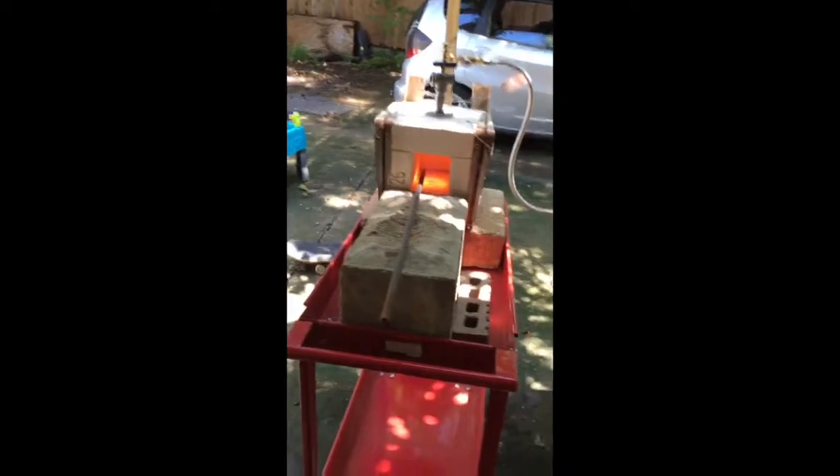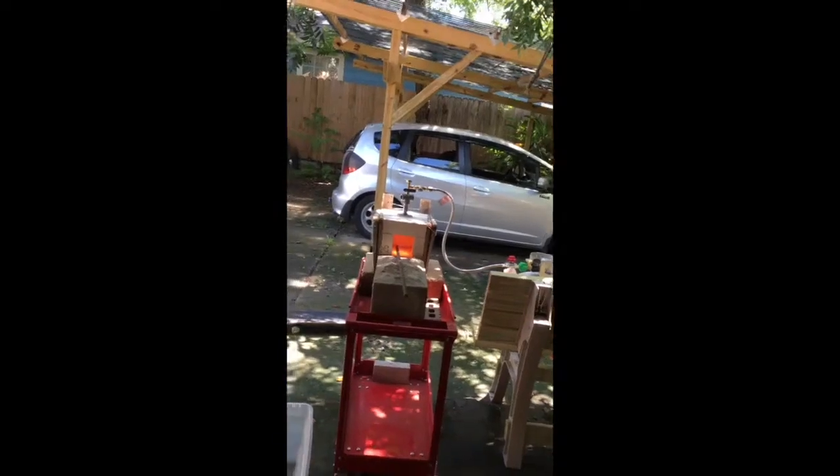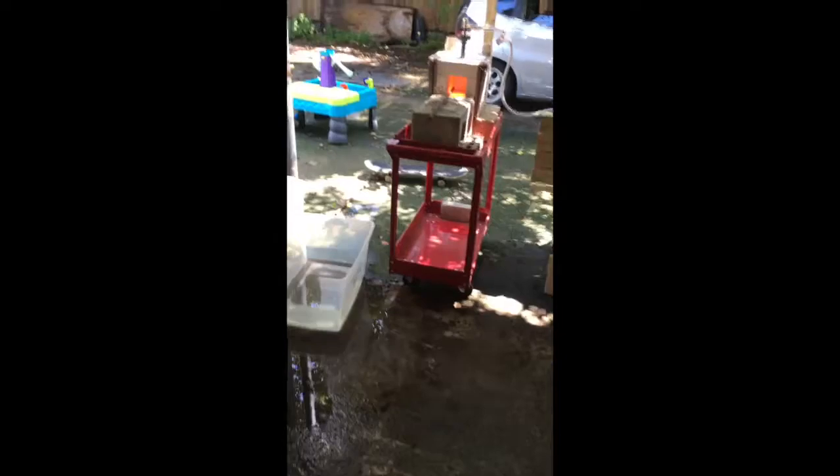The forge is running in 30 seconds. It's quite high — running pretty good actually, a lot better than I expected. Extra water here, water here, anvil here, and the path of the fan is keeping it nice and cool. Everything's blowing outside out of the garage air, so there shouldn't be any fumes. Just in case, there's a carbon monoxide detector right here on the side where I'll be sitting. So we are ready to start forging.